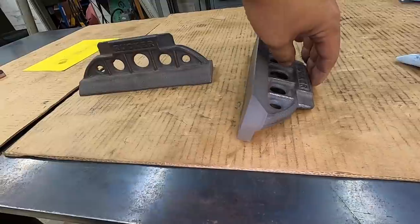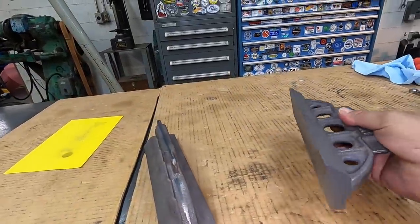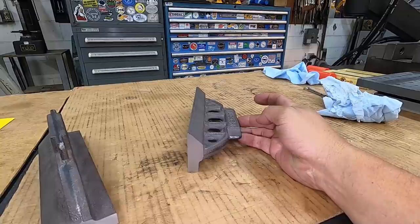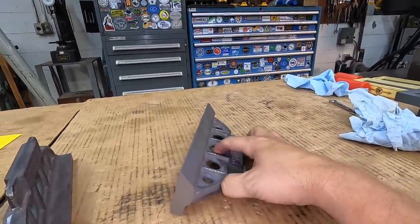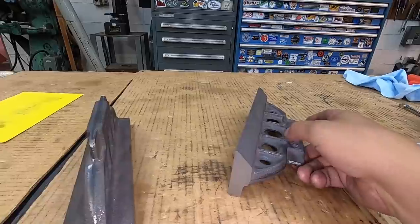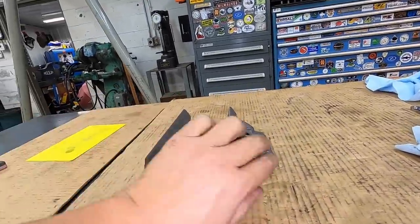I think I am going to use the shaper for this op — it just makes it a little easier to set up. I can set it in the mill vise just like this, clamp against the top of the straight edge on the moving jaw, fixed jaw there, and then we can turn the tool head over to 45 degrees and finish cutting this out right there. I'll bring it back once I get it set up and we start making these cuts.